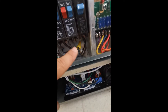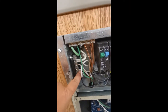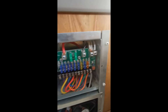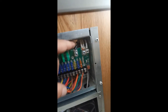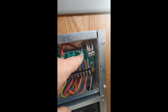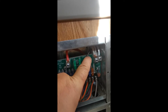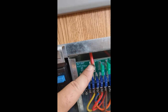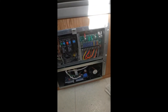We've got our black into our breaker, our ground going into the ground bus, and the neutral going in at the bottom where the old one came out. Wires are pulled through, everything's bolted in. We've got our wires connected: battery negative to the converter negative, and converter positive — which is our black wire fed from down here — and then our red going to our battery.